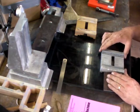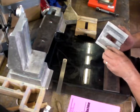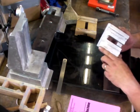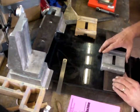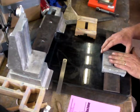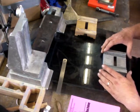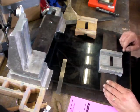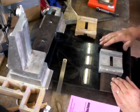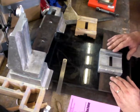To adjust that angle requires the filing of these clamp landings to bring this way to 90 degrees to the bed ways. That'll be interesting. Like I said, if I'm not happy with this, I'll make another one. But I will persist with this fellow.